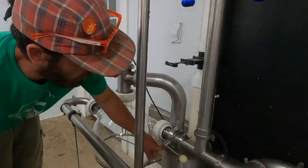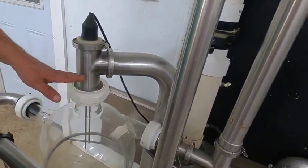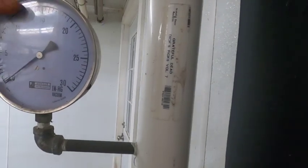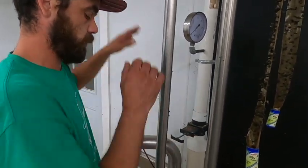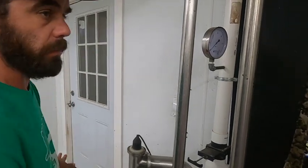This is the sanitary trap. So if your level switch fails, and milk goes up so far past where it would be picked up, it goes into the sanitary trap before it goes up into the vacuum. This is the main vacuum line. This is so you can see, reading on the gauge, we should be like 11 to 12 for goats. And then this is your emergency cutoff valve in case you notice this thing is filling up full of milk and not pumping. You can slam this valve down and this will shut all vacuum off to everything down here, not the pulsation. We'll keep the pulsation going, but we'll turn off all the vacuum on the pipeline.